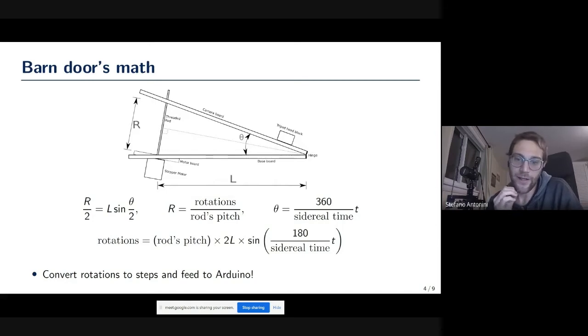For the program, we started from that program. We made some small modifications to have a three position switch and to have this feedback loop happening more often than the person that did it wanted to do. Also, there is another thing that we did but then didn't use, which is to have this operation done by a computer instead of the Arduino, because this is a little bit heavy for an Arduino. So I wrote a program that sends this data to a computer, makes the computer do the operation and sends it back to the Arduino. It could have been better and faster and avoided tracking errors or missing steps, but it ended up being fine without it, so we ended up not using it.